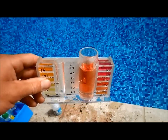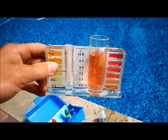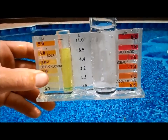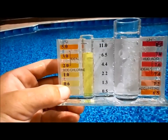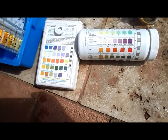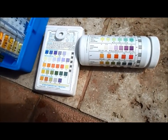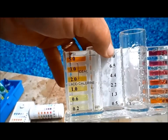That's why it's important to have a standard test kit along with the test strips. If you're going to use test strips, you definitely want a standard test kit for acid demand and to check your chemicals. I would prefer you test your pool with a regular OTO drop test for a more accurate reading — we're looking at about 1.0 to 2.0 in chlorine here. It's not to say that test strips aren't accurate, but you have to read the color carefully, and human error is involved. This kit's color spectrum is really broad, from really light yellow to dark orange, so it's much easier to read.